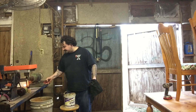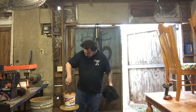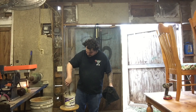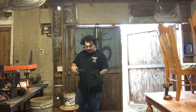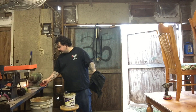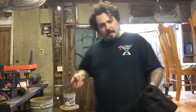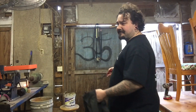Whenever you get it to your nice color or temperature, pull it out and quench it. You will get some fire. Stir it around in the oil, then pull it out fully, give it a quick wipe, and back into the forge. Normally at this point I'd turn it around and start doing the other end, but we're just going to double up on this end so you guys can see the nice black finish it gets.